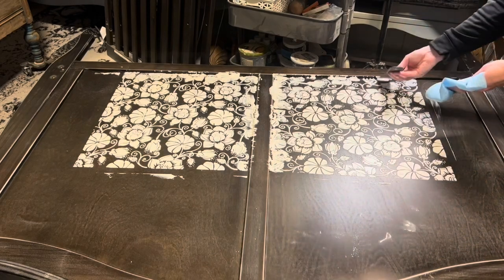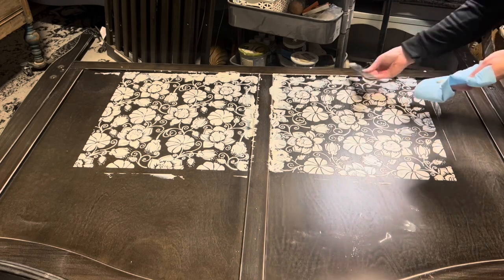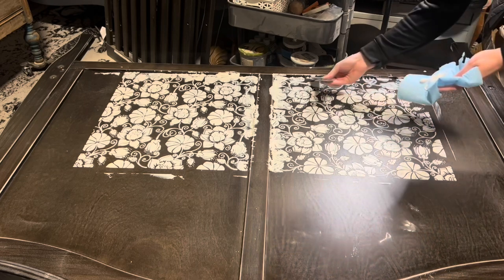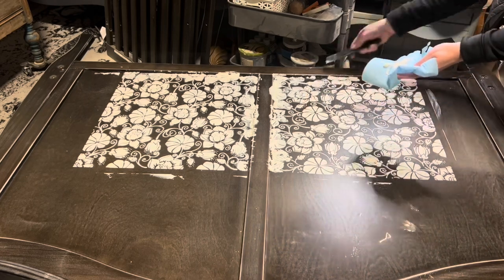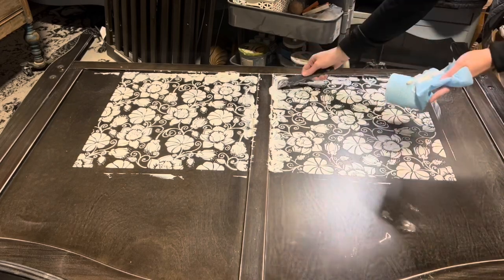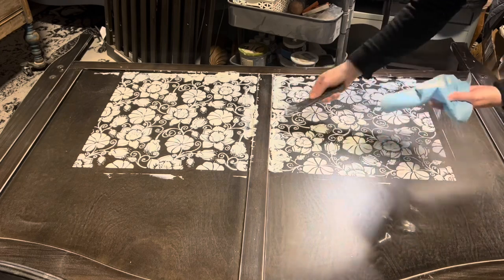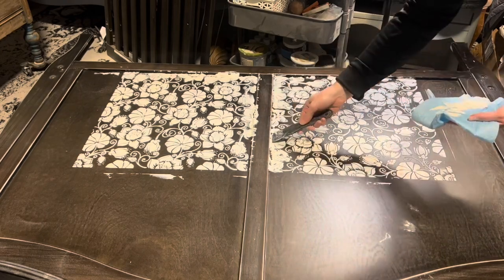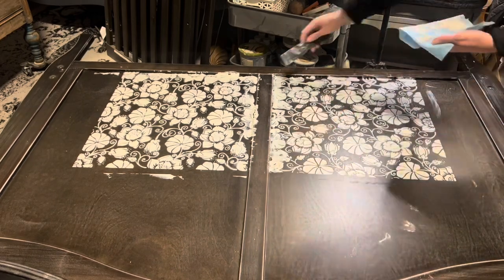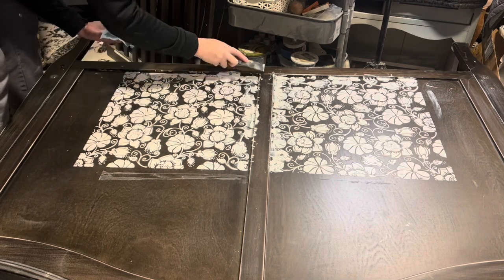Here's where I'm cleaning up the edges. I take a smaller spatula and kind of shove it in and lift off the excess compound. I'm still keeping the shape underneath, and sometimes it might smudge a little bit, but once it's painted it just looks like texture and it's fine. If you can slide it in there without messing up what's underneath, and get it right where there's just that extra amount sitting there, you cannot tell this was a stencil because it doesn't have that bare area going around the edge. I also use the same spatula to clean up any extra parts sticking up anywhere that wasn't supposed to have joint compound.